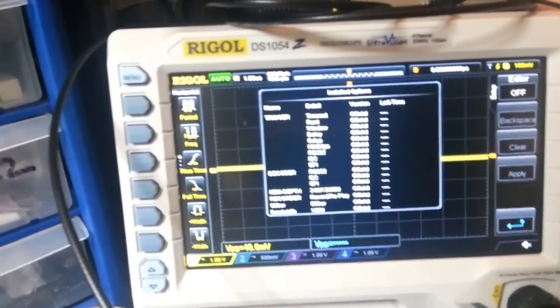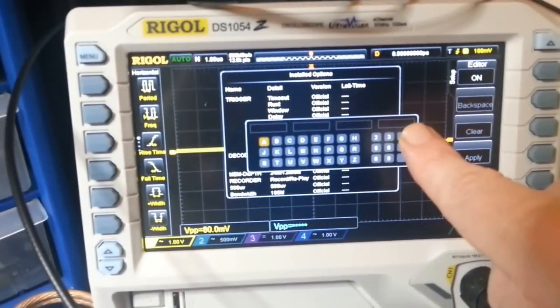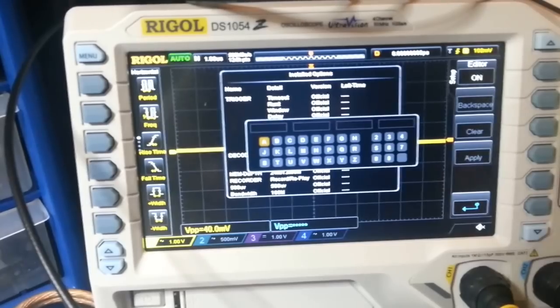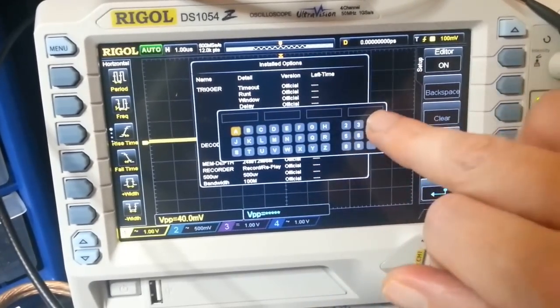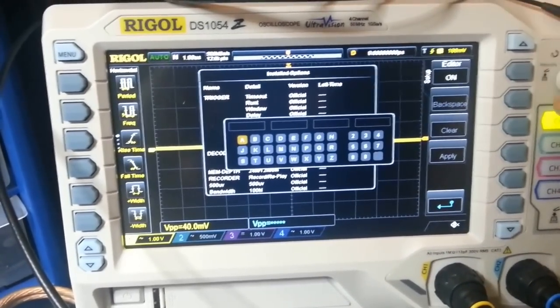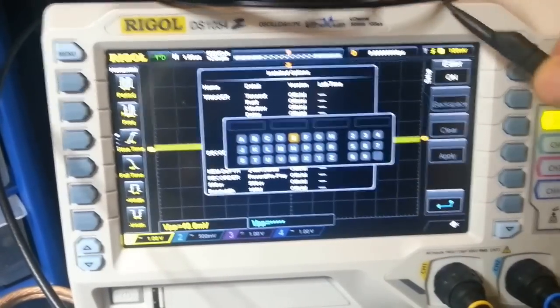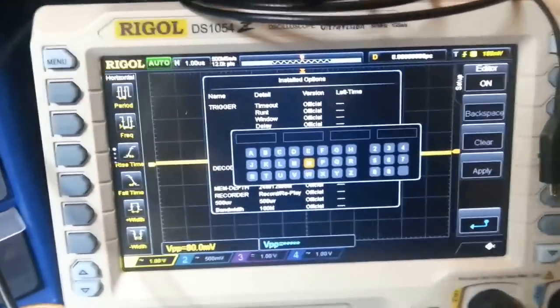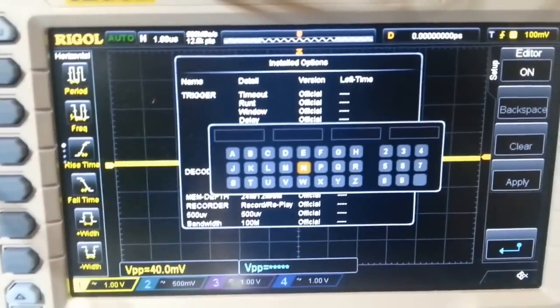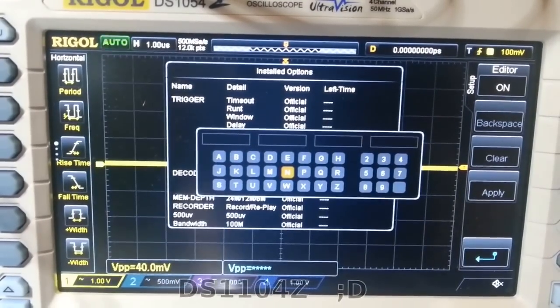Then you just come back here, click into setup, and turn on the editor. As you can see, you've got four boxes, and on the website page you'd also have four boxes — basically four groups of characters — and you just fill this in. It's on the rotary here, which can be a little bit tricky, but you get used to it. As you can see it's flying around here because I've got wires hanging over my finger. But you get used to it, put your numbers in, enter it all in, and as long as you do it correctly that's it — it will open up all those options and turn your scope into basically an 1104Z.